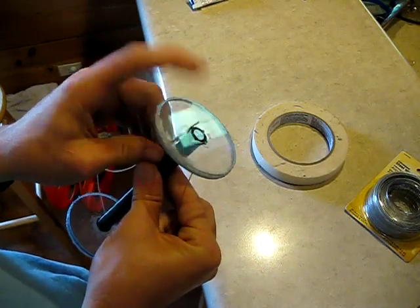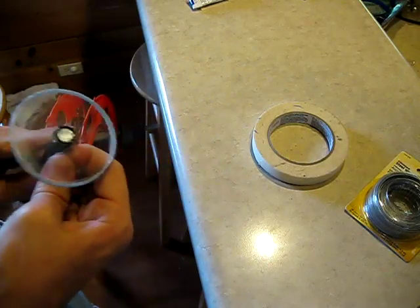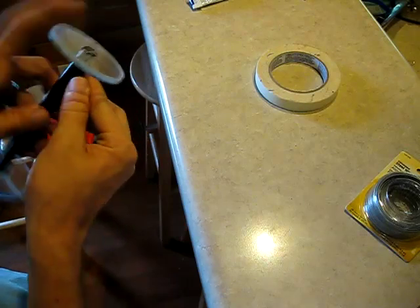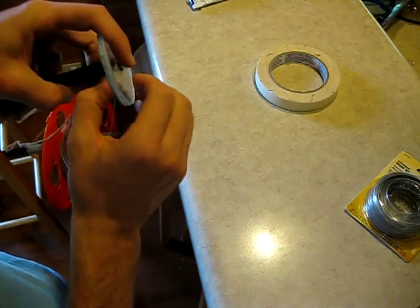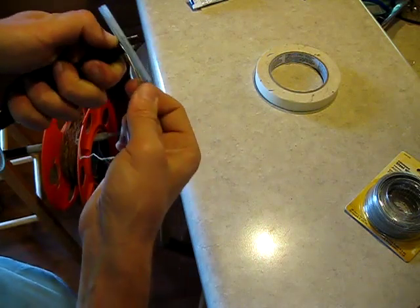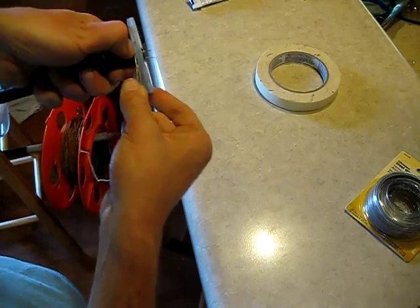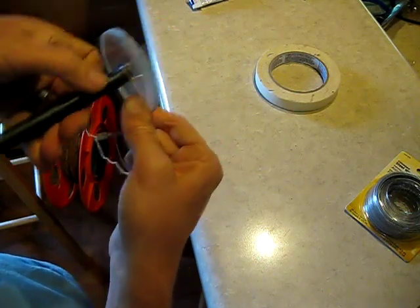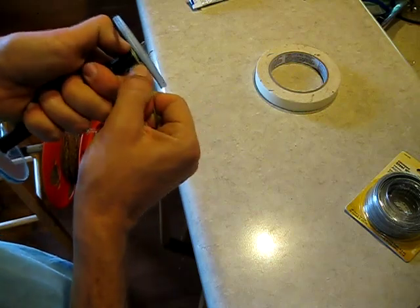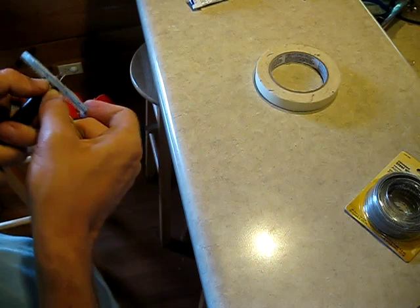I'm going to bring the copper wire up and let it stick up about a quarter inch, then come over and bring the iron wire up through the hole as well — each protruding about a quarter inch. I kind of support these wires to get a really tight bend to start the winds. I like to establish early on which goes on top and bottom. On this first wind, the cotton-covered copper wire is on top and the steel wire is on the bottom. You have to keep quite a bit of tension as you work, and I keep sliding these over with my thumbnail to keep them nice and tight and close to each other.